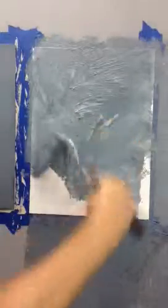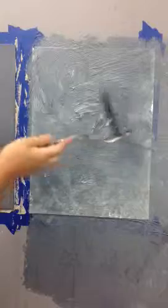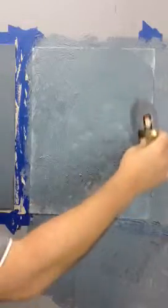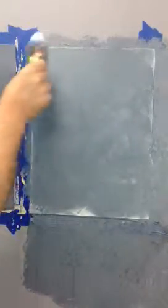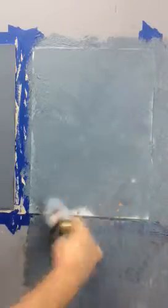We do want a nice heavy application for full coverage, so you roll on a pretty thick slurry using a microfiber roller. Then I'm going to back-trowel it while it's still wet. You can wait ten minutes or so, but basically what you're trying to do is just create a semi-smooth surface. Some soft pits are okay, not a problem — but generally speaking, little ridges are good.